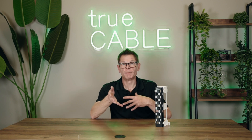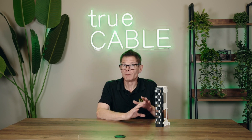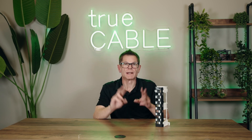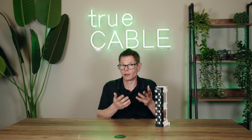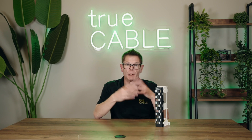What separates TrueCable's Category 6A patch panel from others on the market? It's a keystone panel, so it's easy in, easy out, easy cable replacement. With a punchdown-style monolithic panel, if something goes wrong it usually affects the whole panel and you have to replace everything and reinstall all your cable. With this keystone design, if a jack goes bad in the unlikely event, it's just a simple single-keystone replacement — not all of them — and you don't have to disturb all your cable at the same time.